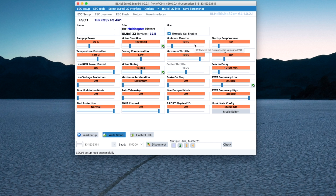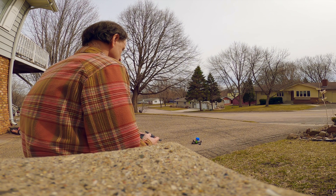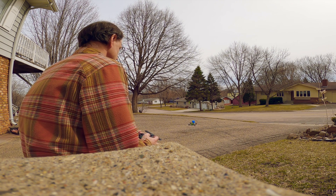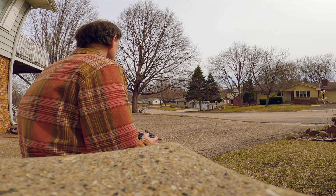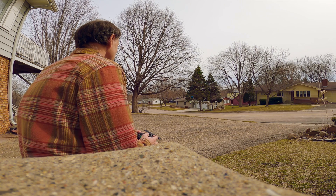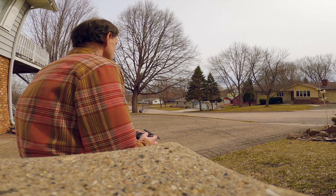Now I think I'm ready to go outside and give it a test flight. Now that I've updated the firmware on the ESCs, I'm going to take it out front and do a line-of-sight hover test. If it hovers, I'll just fly around a little bit, and if all that looks good, I'm ready to actually take it out flying. It hovers — yay! That means everything's at least halfway decent. As soon as my batteries are done charging, I can go out to a better spot and test out this new ESC firmware.